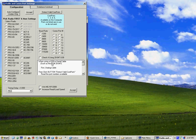They all use a USB to serial cable, which is RS number 20-047. You'll notice there's a little scrolling box that has some tips on how to find the COM port so that you can assign it to your scanner and then get connected. First I would suggest that you unplug the cable if you have it already plugged in. If we look up here at the top while we unplug the cable, you'll notice that it says we already have COM port numbers one, three, four, and five on this computer — meaning they're not being used; these are the ones that are free.